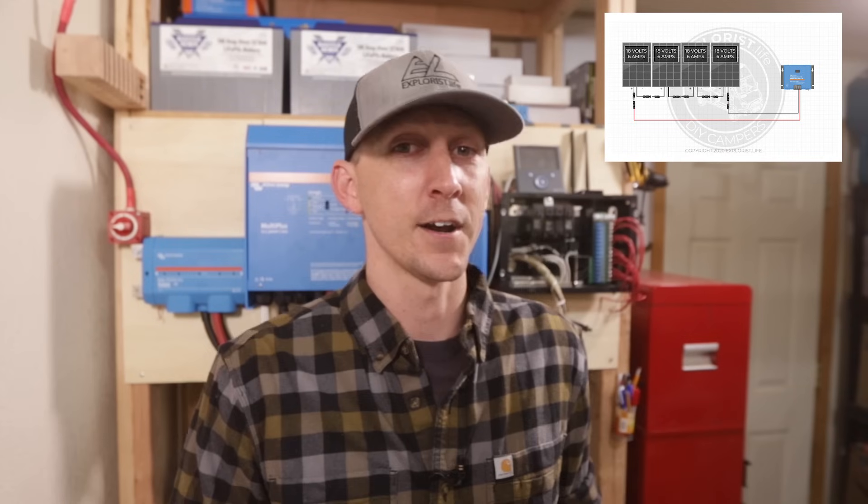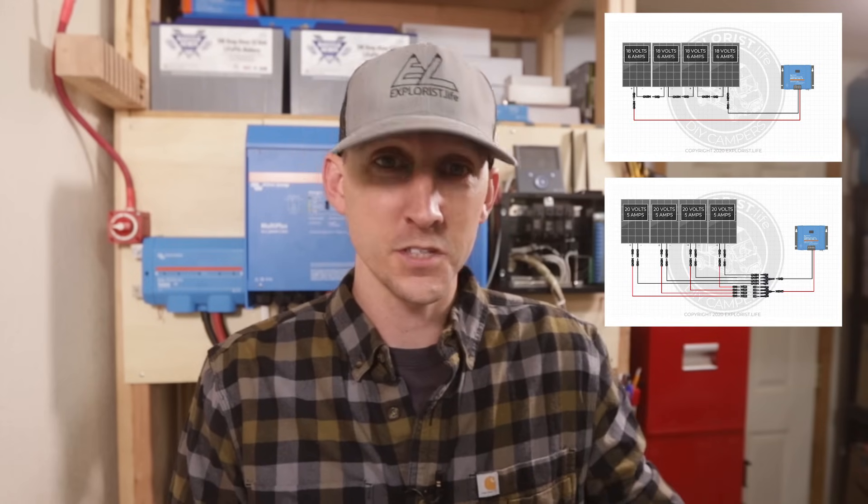Over the last three weeks I've taught you three different ways it's possible to wire a solar panel array. We covered wiring solar panels in series, wiring solar panels in parallel, and wiring solar panels in series-parallel. Now that you know how to wire those different configurations, this video and the next few videos are going to teach you why you would choose one over the other and a few additional considerations. This is really important because we need to be able to alter the voltage and the amperage of our solar panel array so that the power is being delivered to our solar charge controller at a safe and efficient level. We can alter the voltage and the amperage of the array depending on how the array is wired.